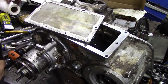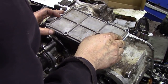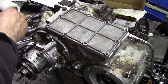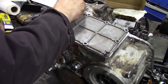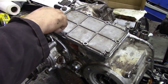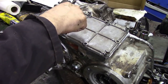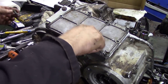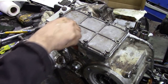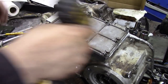I've got a coat of Hylosil on there, everything's nice and dry. Drop it on and just lightly move it around like that to settle it down. There were no gaskets on these, and we've cleaned the bolts out, so I'm just going to whiz these down with the impact gun and then we'll torque everything down later. I don't like torquing things down when there's no need because the torque wrench gets on the bench and gets all messed up.